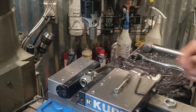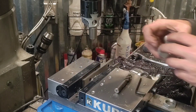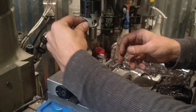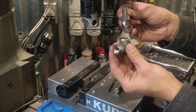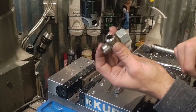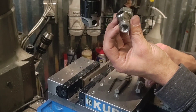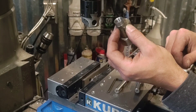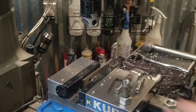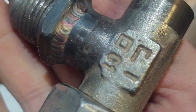That last bit was on time lapse - I didn't realize it, but I threw a chamfer on the edge of this. I just stuck a countersink in the boring head and countersunk a little chamfer on there. We'll get a fitting, weld that on there, and this part will be done.